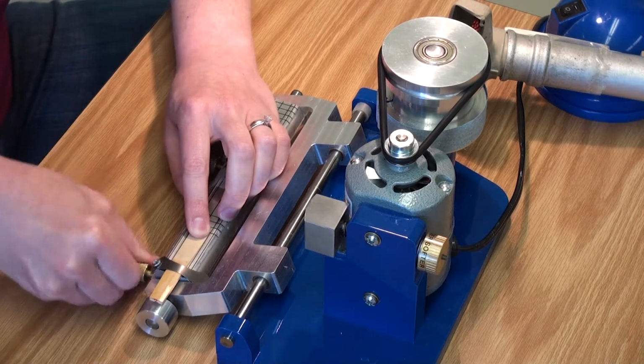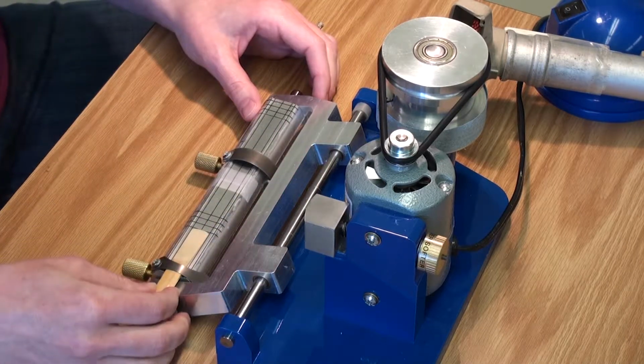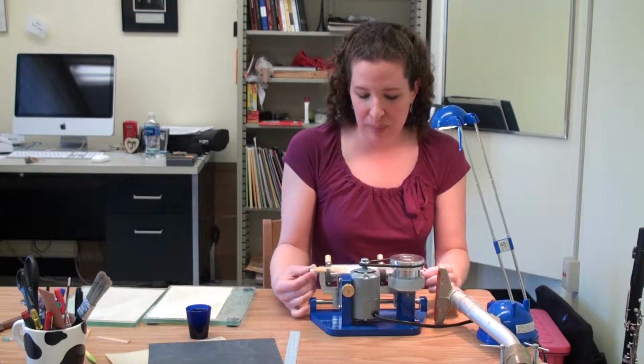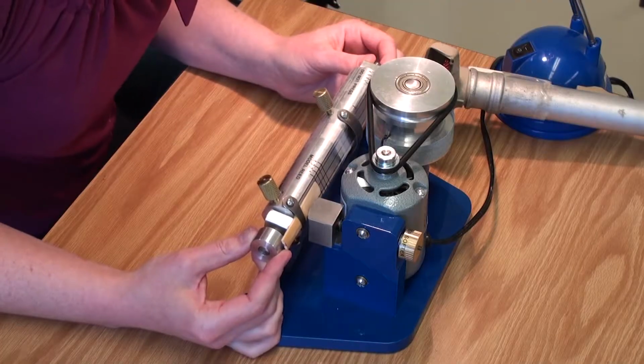So you tighten it down so that it doesn't wiggle around. You see it's in there pretty well. The purpose of putting the model reed over here is once it's attached and you flip the cutting arm up into position, it touches against this, which basically traces it.